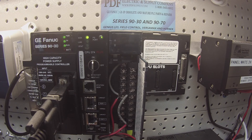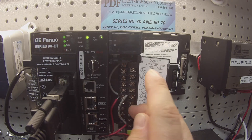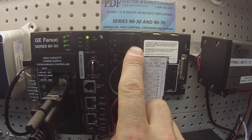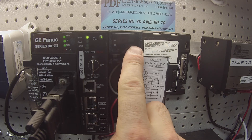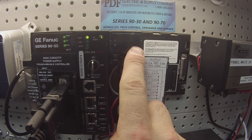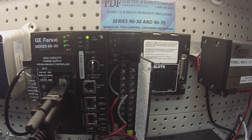Another thing — you may not be able to see it through the camera, but there's a tiny F indicator there for fuse. If something does go wrong and it turns out to be a blown fuse, this little F here will turn green. An LED will come on telling you that there is a blown fuse in either the A group of channels or the B group of channels. That's another thing you can look for that's pretty much a dead giveaway.